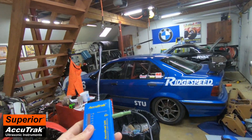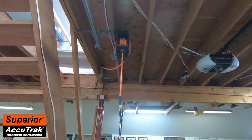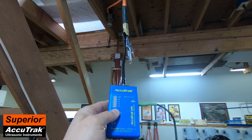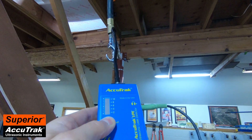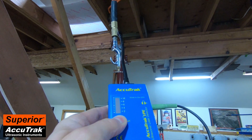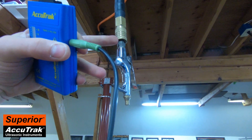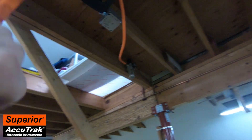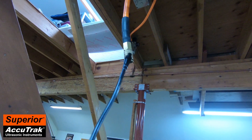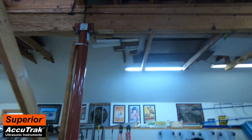I'm going to adjust the sensitivity to match the environment — sometimes it'll work better with it turned down just a little bit. Here is a reel; I left a tool on here, and you know these quick disconnects sometimes leak. Sure enough, we have a leak right in this quick disconnect. It's kind of my fault for leaving the tool in there, but if I take the tool out then we have no leak — so that's not really a bad leak right there. Let's keep scanning along the ceiling.